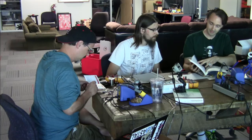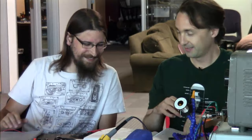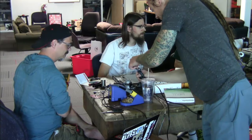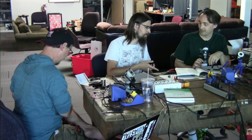Should we share the paper of the record? We'll get there. But yes, we should probably talk about records. A record these days is a circular piece of vinyl where the music is represented by a groove that has been cut into it, a little mountain landscape dug into the surface with a little cutting bit. In fact, I think they called it a chisel in here. And as Pete was saying, like a wax cylinder, the groove exactly represented the audio that had been applied. There was a diaphragm that moved a needle to make the cut. And then the opposite works as well. When you're playing it back, that needle moves the diaphragm the same amount that the recording exactly was.